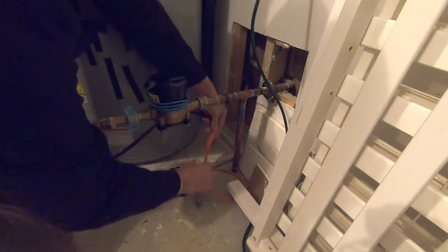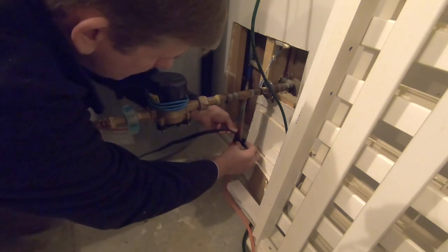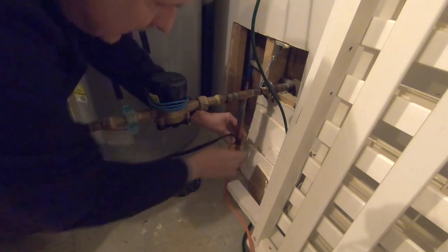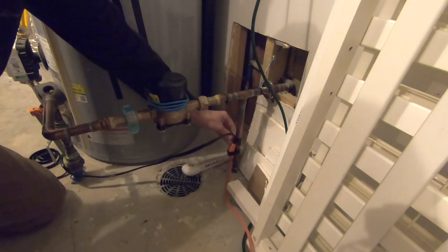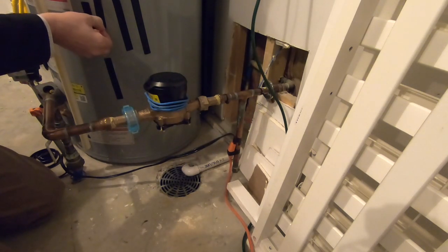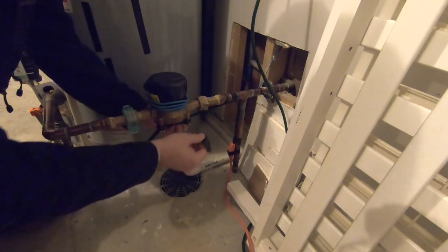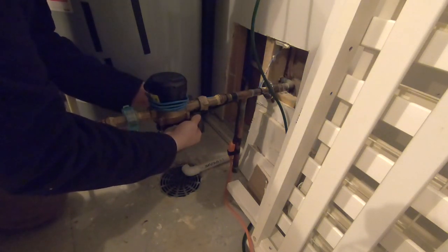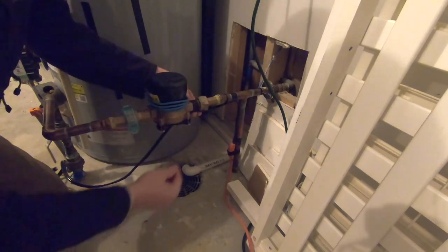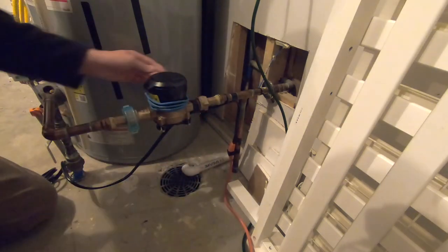The way to install this is to apply the thermostat to the pipe itself where it's going to be cold, and this area right here is perfect for that. I went to pre-cut some tape. If this were outside, they want you to apply the heat tape to the underside of the pipe. We're going to do that on the underside because we're coming back on the top side, since we only have a three-foot section and this is six feet of heat tape. The directions are very specific that they do not want you spiraling the cord around the pipe, and they don't want the heat tape itself to come in contact with itself. That's something to be aware of.